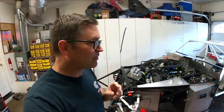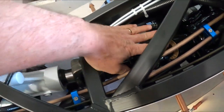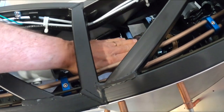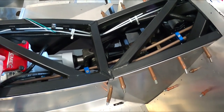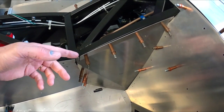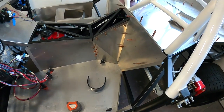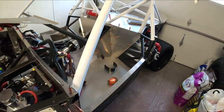We found the driveshaft down past the finish line, bent up like a pretzel. Somehow it kicked out from underneath the car and hit the driver's door — it could have gone through the windshield or up through the floor. That's one reason I'm putting in the loop. Even though this driveshaft is only about seven or eight inches long yoke to yoke, you're sitting right next to it, so the odds of it hitting you are real.